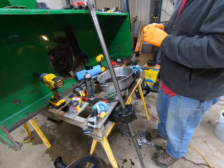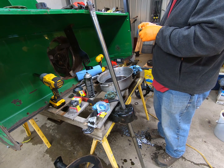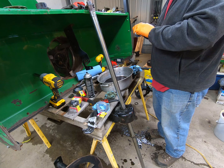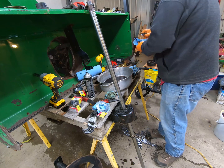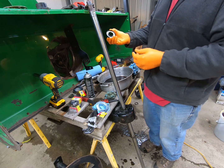All right, got my grease. I haven't seen very many places where you should put a seal in dry, but there are some places like that. I'm not a fan of doing such things because the last thing you want is an imperfection somewhere in the shaft to impact your seal.